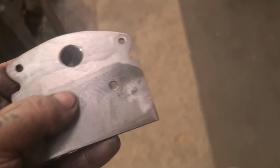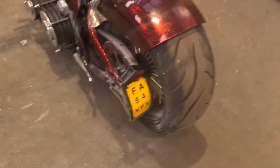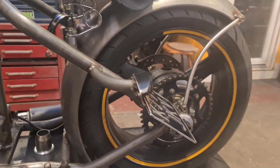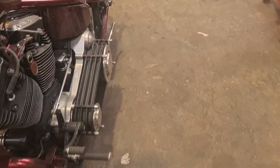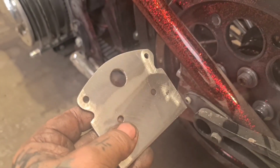Okay, so last minute, the side mount. I've been on the phone to our Dean and we're fucking that side mount off because, well, it's shit, that's why. Now, he's not actually seen mine on my Triumph, and if you follow my exploits, you'll see that there's a video coming up, part 5 on this build, but we're going to make the same thing here. So we've got ourselves a bit of plate cut off camera. We're going to get ourselves a nice 90-ish bend of inch tube thereabouts, and we're going to weld it on here. That's what we're going to do.